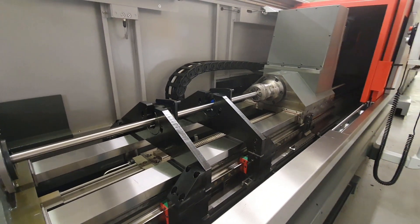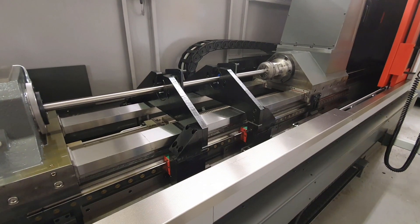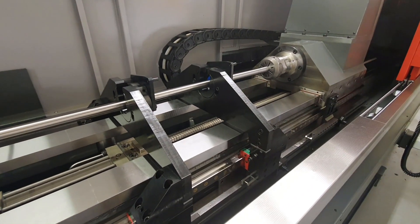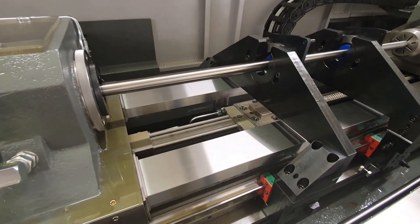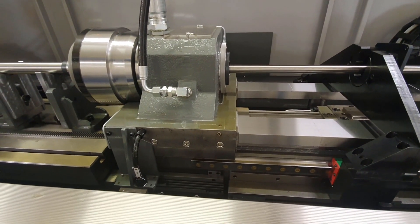Whip guides act as tube dampers — they're heavy-duty and auto-positioning. A large ball screw provides heavy-duty pushing for the BTA, and the pressure head is hydraulically driven forward and hydraulically clamped during the drilling operation.